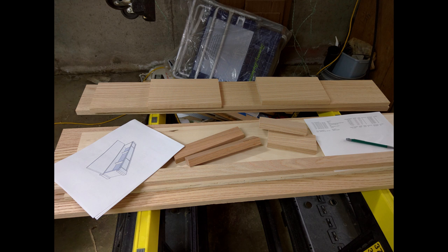So I made a cut list and cut out all my pieces first. When I made this design, I made it so I'd have to do as little cutting as possible — I redesigned it a little so I could use all stock oak, either 1x6s or 1x2s. Later, that came back to bite me a little, because not all 1x6s were created equal. Some were three-quarters by five and a half, but some were three-quarters by five and a half give or take — I didn't realize that until the end, so I ended up having to cut the pieces anyway.